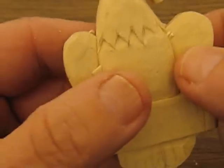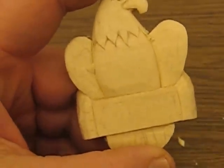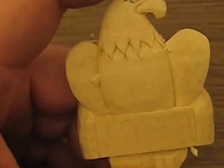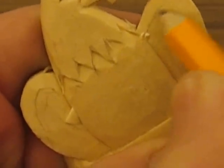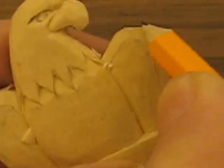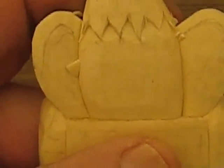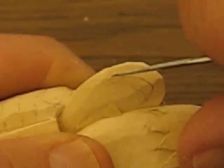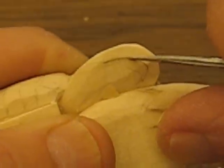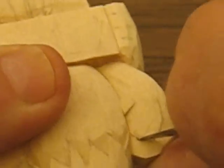So what I'm going to do is put some lines in — we're going to do the feathering on here. It's tucked — let me show you this real quick. It's up and around, and this is like the ridge of when we taper it off. I'm going to round these off, and then we're going to put a little stop cut and cut underneath. So let me do one wing and you can do the other wing later. I'm going to go ahead and do this one over here. We're going to take a little stop cut, up and around — remember I turned it the other way to get in that corner. We're going to take it out and around.